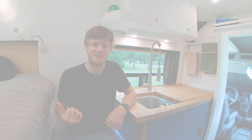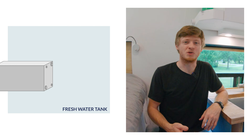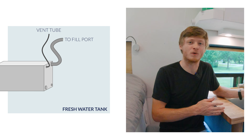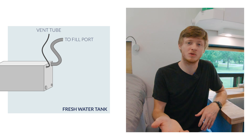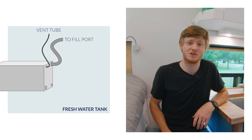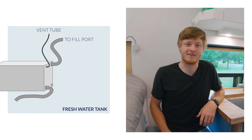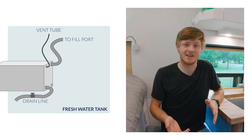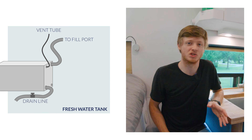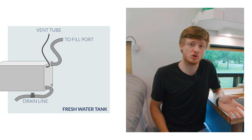Let's talk about all the connections to the tank and start to build out a diagram. Besides the fill port, the other connection at the top of the tank is a vent tube. As water is drained or the tank is filled, air needs to be able to move in and out — that's the purpose of the vent tube. Just like the fill port, the end of the vent tube should be located sufficiently above the tank so water can't splash out while driving. Many fill ports have a spot on the back where the vent tube can be connected. At the bottom of the tank you want a drain line with a valve — having an easy way to empty the tank helps with both cleaning and winterizing. The tank I used has threaded fittings built in: two one-and-a-half-inch for the fill port and drain line, and two half-inch for the vent tube and pump line.